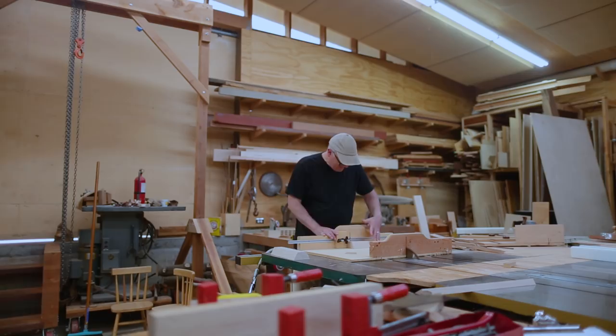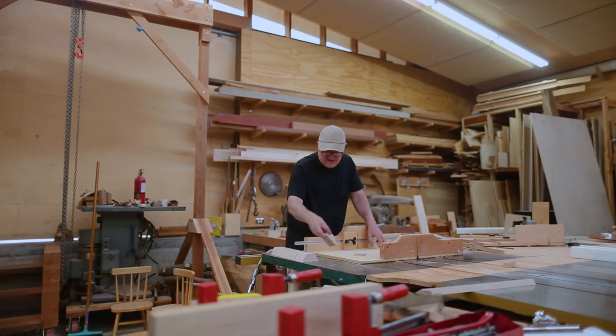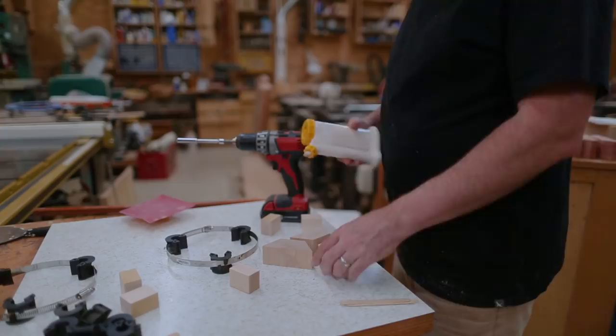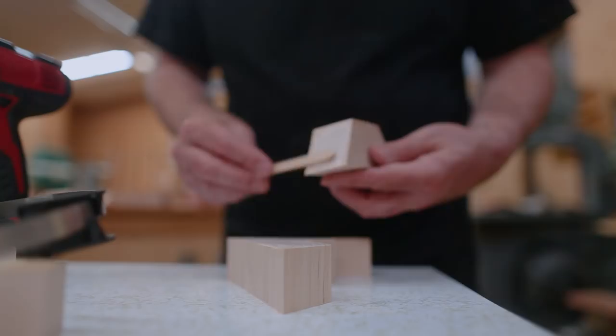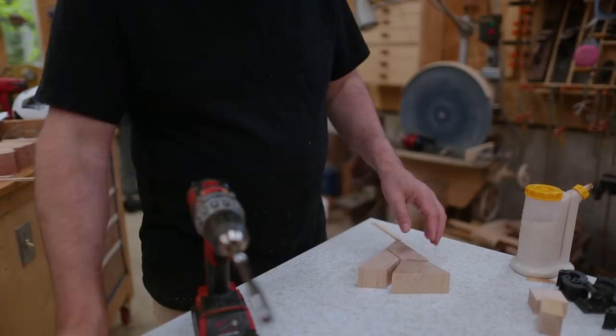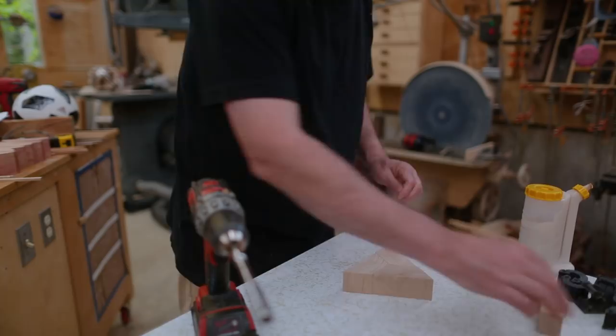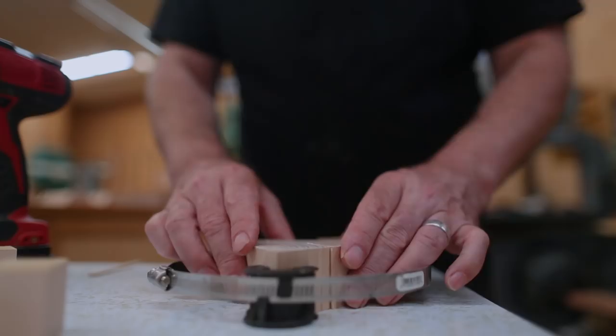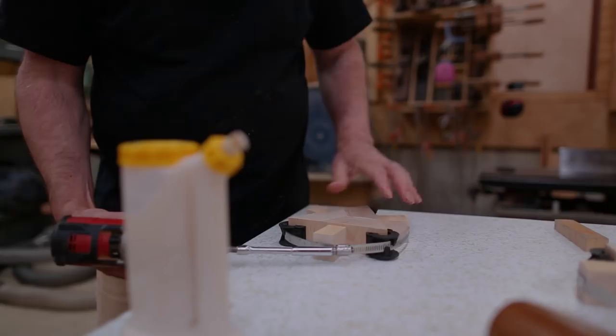In doing this, I began to think I should probably cut these into the shorter pieces before I glue it all together. One reason was I didn't really have a saw that could cut the height of the triangle in one pass except for the bandsaw, but that wouldn't leave the best surface, and I would have to make some kind of jig to hold it square to the blade. I could also be more sure that the blocks were going together tight when they're short like this instead of a long section I can't see into the middle of. So it was the same clamping setup with the ring, the corners, and the blocks in the middle.